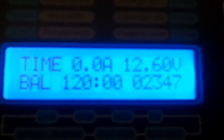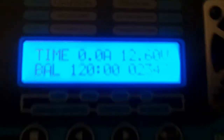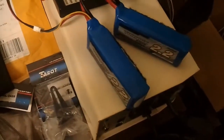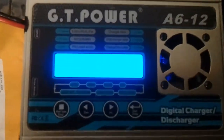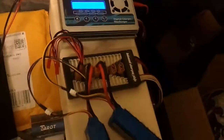After two hours, we put 2347 milliamps into it. The milliamp count remained unchanged for about the last hour, with 0 amps the whole time — it just would not finish balancing the two cells, two Turnigy 2200 3S packs. So something happened in the first minute. The charger suffered a problem, and this is my video documentation of it.